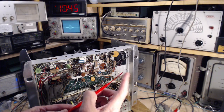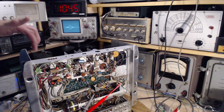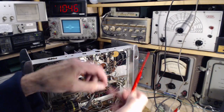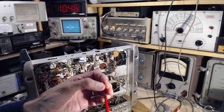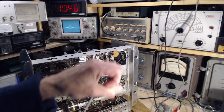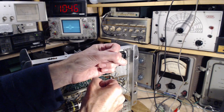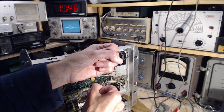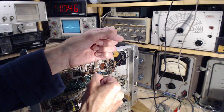This is the business end that's going to turn the slug. The idea is, in these transformers, there's basically two coils of wire with a carbon slug inside each one, and the carbon slug has a hole in it, in this hexagonal shape. You have the two slugs inside these coils. My hands are the slugs, and you adjust them up and down in the coils to change the resonance of the individual coils. One of the instructions is to adjust them away from each other.